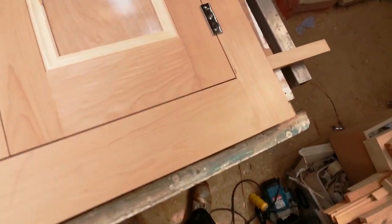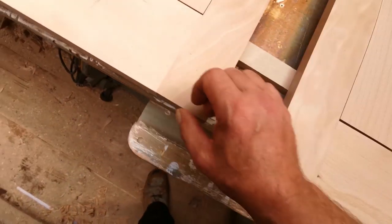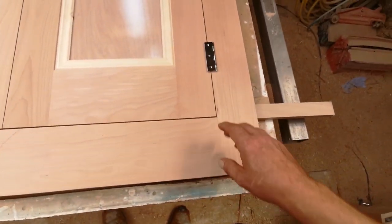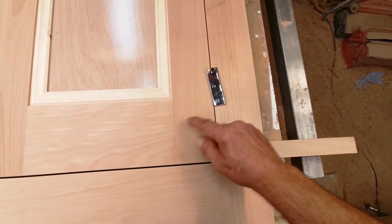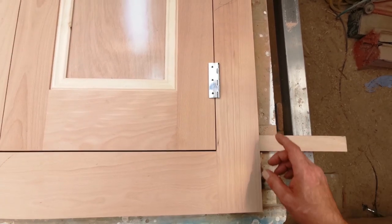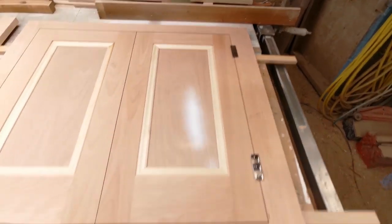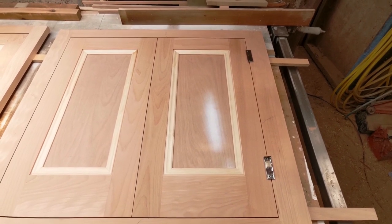Alright, finally hinges time. The little steps on the frames weren't so bad. That one's out a bit, so I suspect it's the machine position of the hinge — you normally avoid the tenon. With dominoes, I think that's just a little too high, so I'm going to drop it down just a fraction. There are no fixed rules, just where you think it's right.